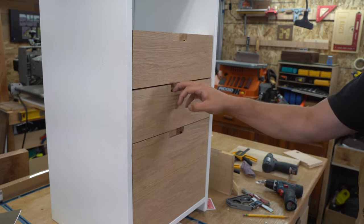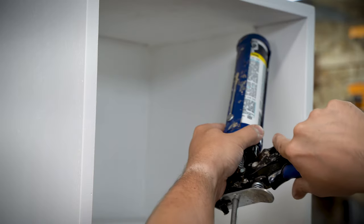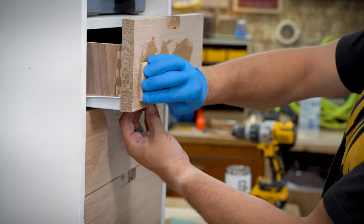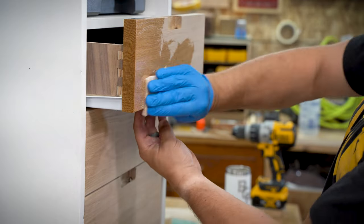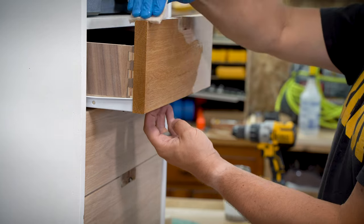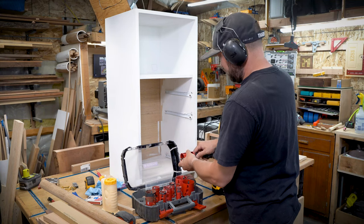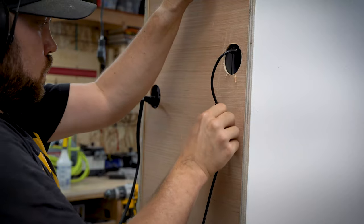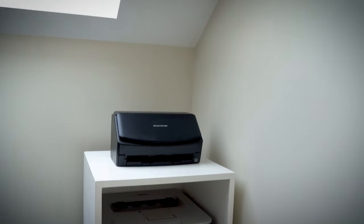Then it's just time for a finger pull test drive and some last-minute touches — a little sanding and caulking of the inside to make sure it looks pretty. Then it's time to bathe this thing in Osmo. I've been vacillating between Rubio Monocoat and Osmo, and of late I've liked Osmo — I like how the finish feels over time. Then the last step is to remove the drawers one last time and cut some holes for the printer. And with that, it's done and ready for the office reveal. And there you have it — the office cabinet build. Thanks for watching.